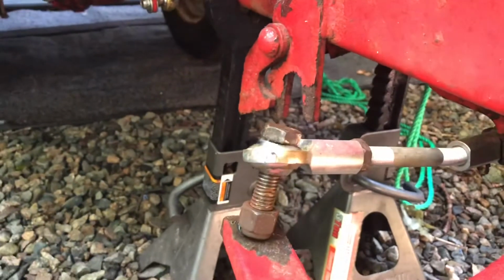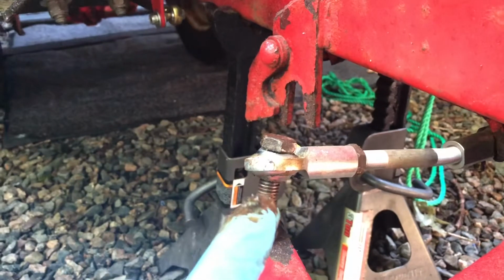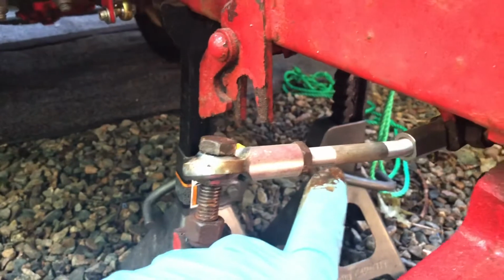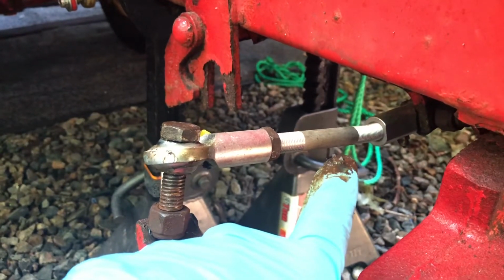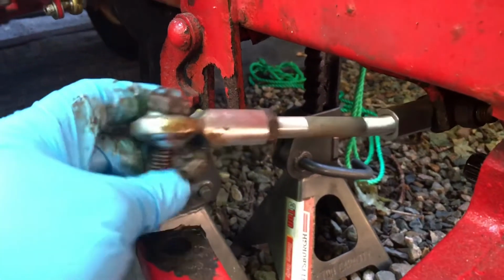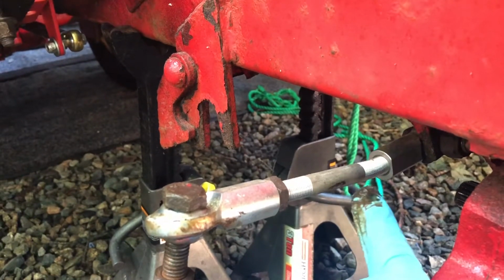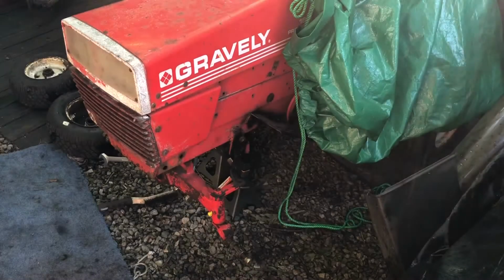These are steering linkages from a while ago, because they were totally seized up when I first got them, because this thing was totally covered in rust. The balls didn't move or anything, so I just ordered these aluminum ones that you can grease from McMaster-Carr. So I ordered one of their connecting rods too, but all they had for this size, which is I believe 3/8-24, are these aluminum ones. As you can see, aluminum doesn't make a good connecting rod, at least not for steering. So I do have some 3/8-24 threaded rod that I will try. Hopefully it's a little stiffer than this. If not, I'll have to make something or find another location for a connecting rod this long. All right, let's see if we can get this front axle off.